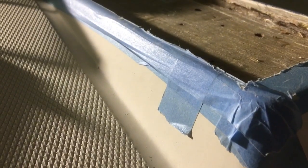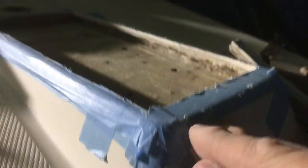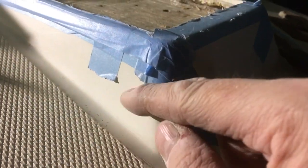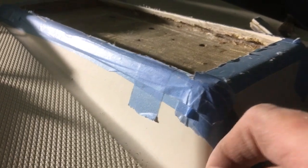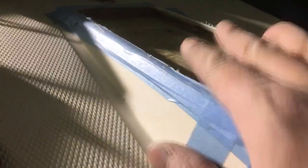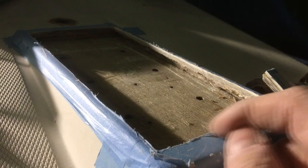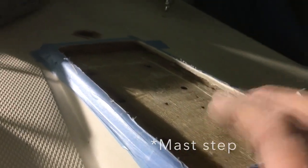And then possibly I'm gonna re-strengthen it a little bit, or let's see. Maybe I will just take the final laminates also around the whole center block here. But that would mean that I would need to remove the old gel coat from here, and then re-laminate it all the way around the mast base block, and then make it really strong, so it's never gonna be bending from here again. It's never gonna break either.